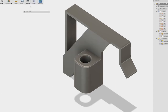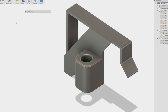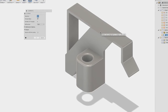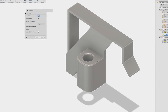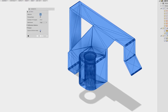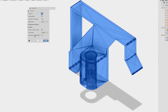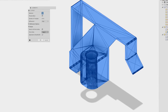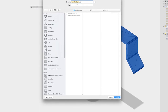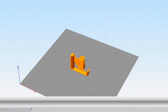Now I'm going to get this geometry out. I've already exported the file, which I showed you, and now I'll say 'Make 3D Print.' The last step is to combine parts — click on the item you want. In Fusion 360 you have two choices: you can directly send the geometry into Simplify 3D or whatever print utility you have. I personally use Simplify 3D. Uncheck your custom settings, hit OK, and it will prompt you to save the part. Our combined part is already inserted into Simplify 3D.